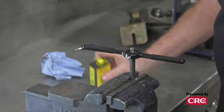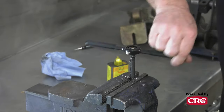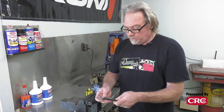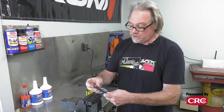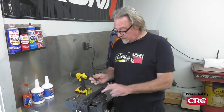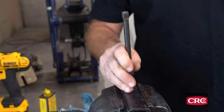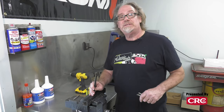You can see the chips falling — we're literally cutting new threads into this. We'll clean this up quick and see if we can put a nut on it. As you can see, it's got beautiful new threads — it looks just like a bolt. Here's a 7/16-inch nut, and it goes on easy as pie. Just for kicks, we'll drill a hole into this piece of steel and thread this rod we just built into it.